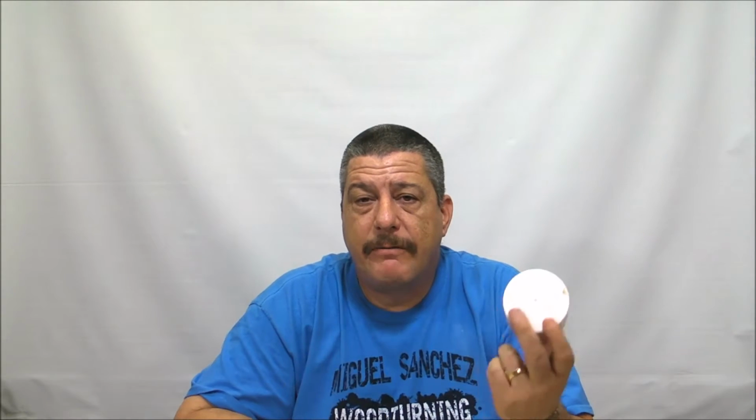So the thing is, you have to sand your piece up to 600 grit, right? Then we are going to apply Triple E Ultra Shine. This is an abrasive paste made of wax, oil and abrasive powder. I'm going to leave you a link below for Daniel Villarino's channel, because he made a version of this paste that you can do at home easily. So it's interesting to see the components of it. Actually, of course, the recipe is not here, but I can tell that it's oil, wax, and abrasive powder.